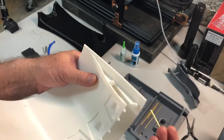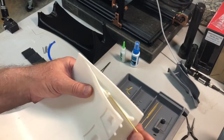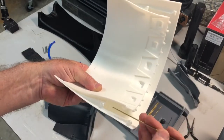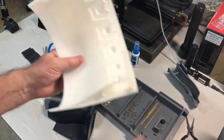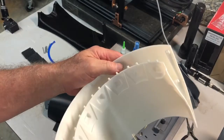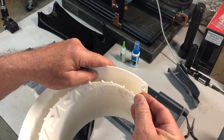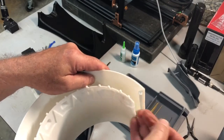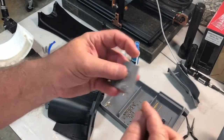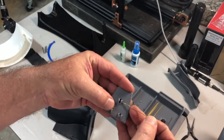Same thing on the trans cowl. These are actual bearings that need to slide nice and smoothly on the rod, so make sure you have plenty of clearance for them to move freely — but not so much that you get a lot of slop. Do the same for the one millimeter diameter blocker door pins using a piece of one millimeter brass rod sharpened and cut to ream. Run it through all those holes to size them, make sure there are no burrs or flashing. It should be a nice slip fit — no real play, but no drag either.